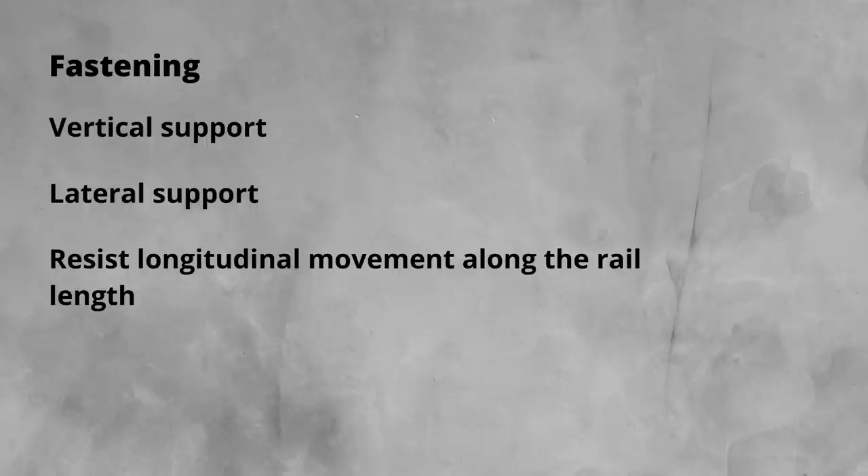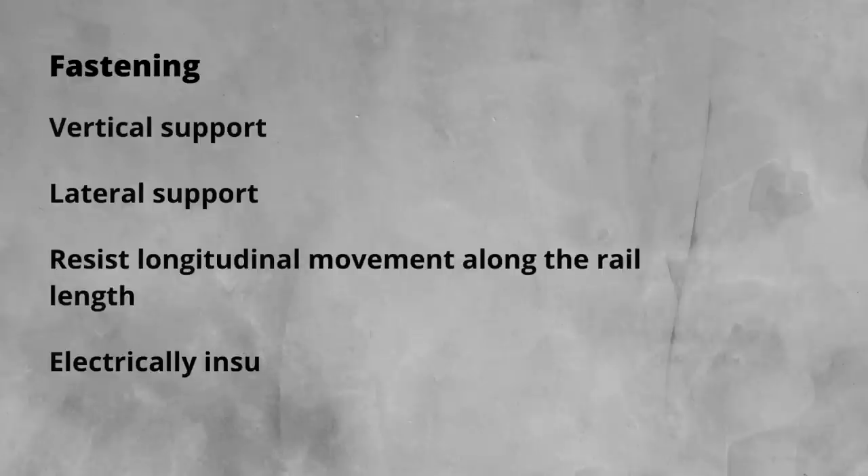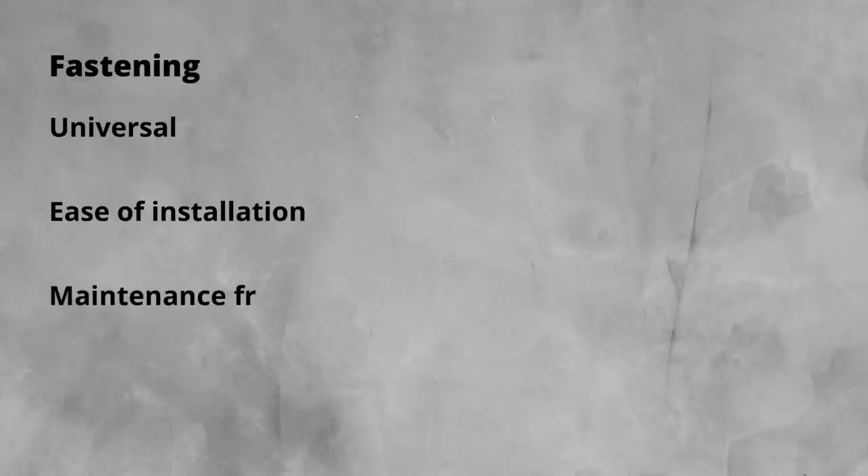This is all achieved by what is known as toe load — the downward force applied to the foot of the rail by the fastening. They also need to be electrically insulated to avoid affecting track circuit signalling systems. Clips should also be universal so they can be used in as many track types as possible, such as both plain line and S&C. They should be easy to remove and install, given that this will be critical to a number of maintenance activities such as rail changes. They should also be virtually maintenance-free, and any removal and refit should not downgrade their performance. Given there are going to be a lot of clips on the railway, they need to do all of this at a modest price.